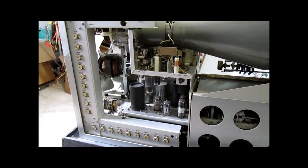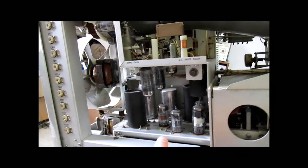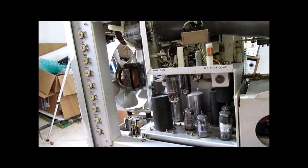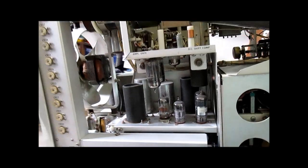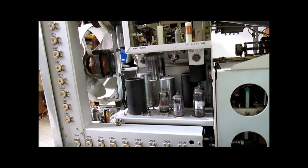Compared to the 545 in my other video, you can see that there's barely any vacuum tubes in here, whereas the other one had numerous push-pull stages to feed the delay line. This particular scope only has a couple of tubes — and that's how they got the extra bandwidth on the 545, by having more tubes in it. This scope is only about 10 megahertz compared to 30.